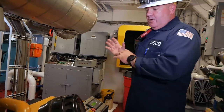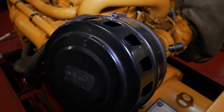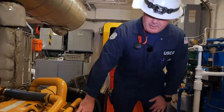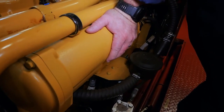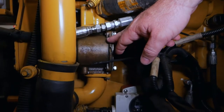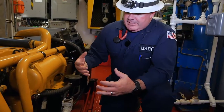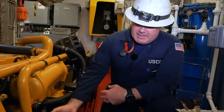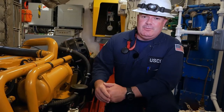We'll basically walk our way through. We have our intake for the diesel engine itself, and our cooler for jacket water, which is what cools the engine down. We have a fuel pump — when looking at the fuel pump, we're looking for any evidence of fuel leaks. Fuel leaks can be identified by a puddle underneath that looks wet. If you see any fuel leaks, it's usually a no-go — we want to stop and make sure we address it.